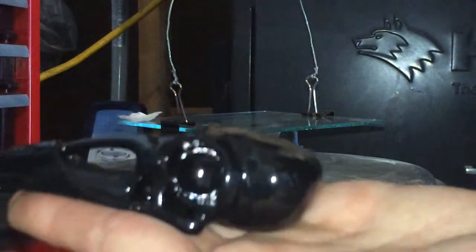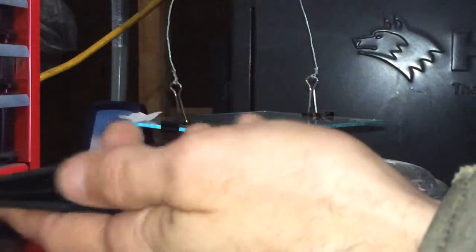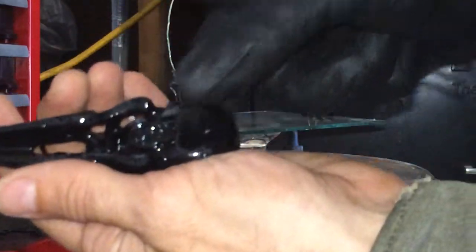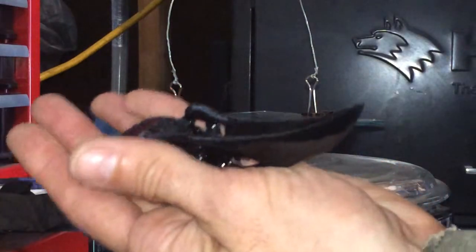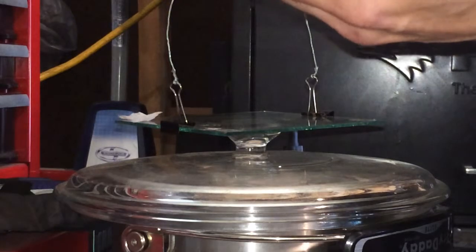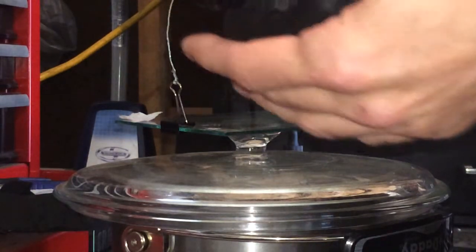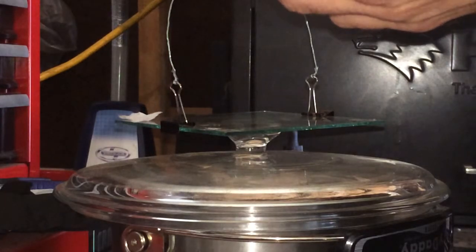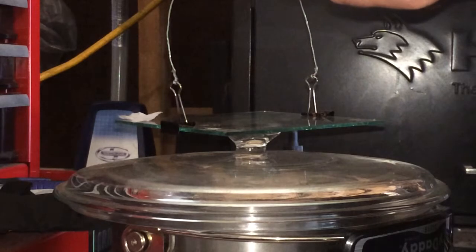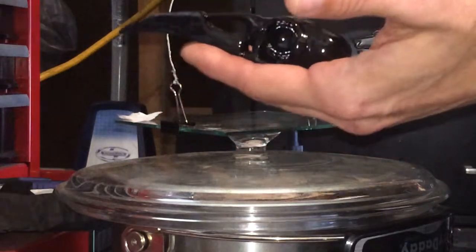That's your basic acetone wash right there — all said and done. There's not much to it. Just take proper safety precautions: well-ventilated area, acetone is flammable and evaporates very fast. Health risks of vaporization are questionable — some people get headaches, some get sore throats — but in a well-ventilated area you shouldn't. If you're really worried about health risks, buy a gas mask with gas vapor charcoals and filters. Acetone is actually a naturally produced chemical of the human body, and if you're Type 1 diabetic you actually produce probably 4 times as much acetone as a non-diabetic person.